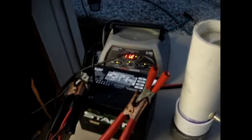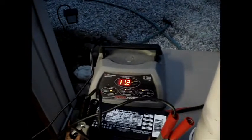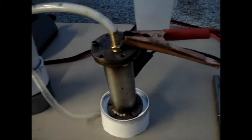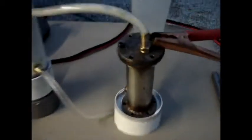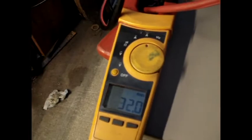I'm sure it's drawn this little battery pretty hard, but it was new and it was handy. It reads about 11.2, 11.1 volts. So that's just one cell at 11 volts. You can see the production on this six-and-a-half tube cell, if you want to call it — I'm only using both sides of six tubes and the inside of the outer tube. We'll put some potassium hydroxide in here and see what the amps go up to. They're hanging pretty good there at 32.